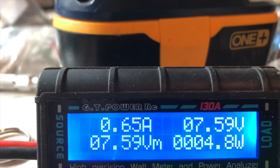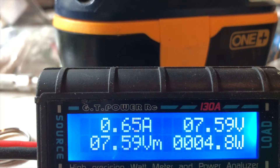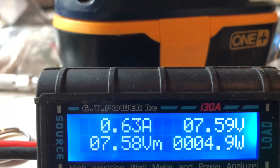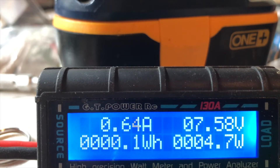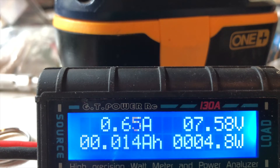It's not exactly a doubling in power draw when you increase your wattage output — but you're doing over half an amp, so you can easily drain your batteries. It's best to make sure your dynamic power is on, as that'll adjust your power settings based on link quality. According to TBS, you can run a 2S up to a 3S battery on the input.